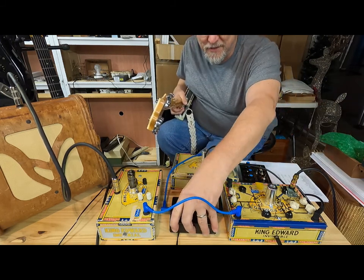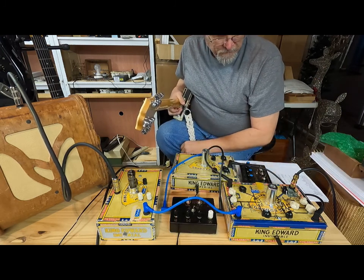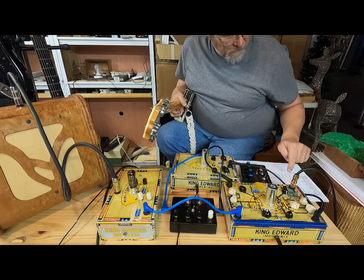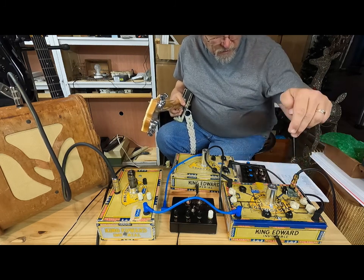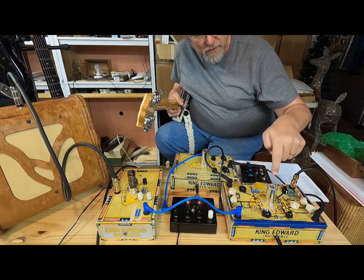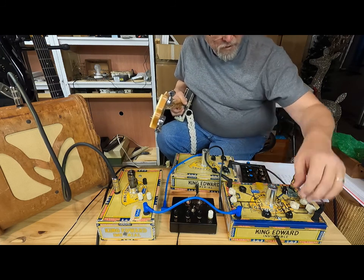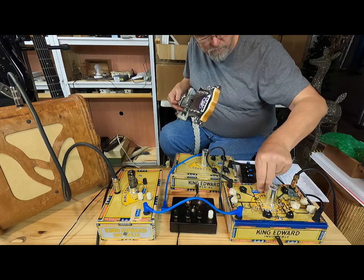That's just changing out the tone stack. So again, really versatile setup. I did have to deviate a little bit from the JCM800 settings. There's a 68K resistor in parallel with the bypass cap, and it seems like I needed to boost that up a little bit more to get it to still run pretty hot.